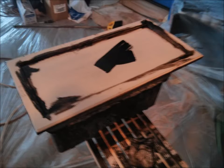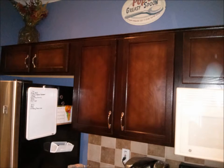We hand-apply the glazing compound, then wipe it off and use glazing brushes to reintroduce different parts of grain on different areas of the door. After that, we begin spraying colored translucent lacquer. In this picture, the one on the left has got only one coat of colored lacquer over the glazing compound; the one on the right already has two coats. After three to four coats, we have the finished product.